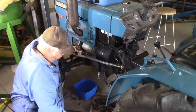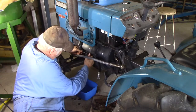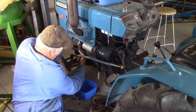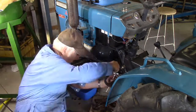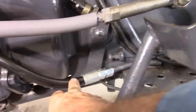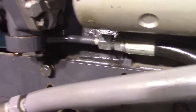Once more into the fray. Big hands and little bolt heads don't go together very well — you end up cramping up. There's a rubber O-ring here so we just want to nip these up tight, we don't want to screw the guts out of them. I always tighten them crossways so it doesn't pull it all the wrong way — I've always been taught that when tightening things with a gasket or an O-ring you always go across and try not to tighten down one side all at once. You can see the pressure fitting there, hose coming down to the other fitting, joining back in on the pipe on both ends. That will clear the front-end loader arm that I'm putting in there, and that was what that whole exercise was all about.